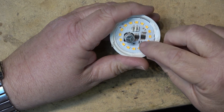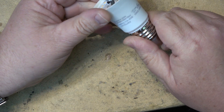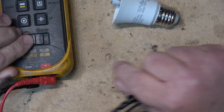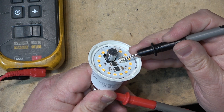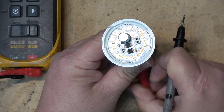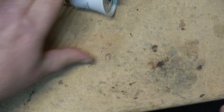What I'm curious about is whether we have a bad connection on one of these ICs, or maybe this connector here where the pins bring power up from the socket at the back. We should measure these with a meter - there's probably a fuse or resistor on one of them, but they should be connected through to the socket at the other end. Let's see whether we've got continuity from the socket through. We have continuity on that one and the tip as well.